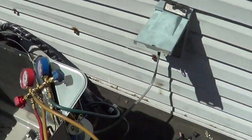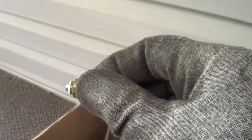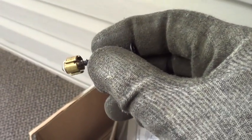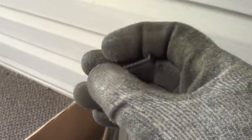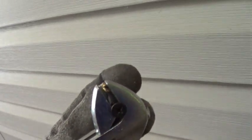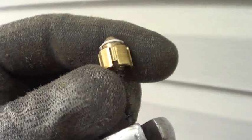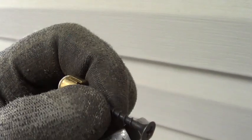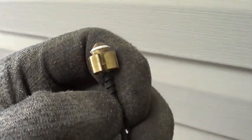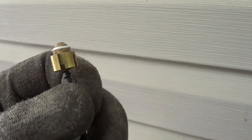I'm going downstairs to change the piston to an expansion valve. I wanted to show a trick to get the piston out - it was over-tightened and would not come out. What I did was use a drywall screw: spin it out with the drill spinning and then pull with the wrench. You can see it actually scraped up getting it out - it would have been impossible without spinning it, and the distributor would have had to be changed. It's out, I've got the expansion valve in, I'm evacuating now and we'll start it up.